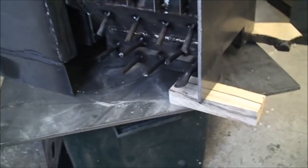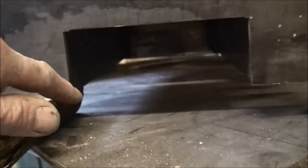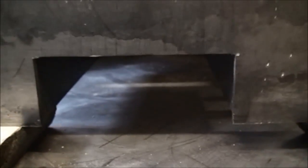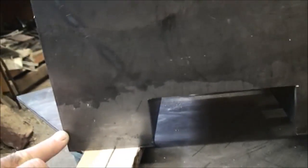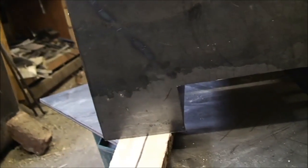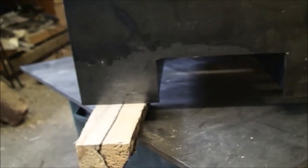So I added an extra inch and a half on that, which gives me room underneath the firebox. You see they're propped on them two bits of wood. Inside the firebox I'll just have to weld a plate on the bottom — there was no plate on the bottom because the shroud was going to run across the bottom there — so I'm just going to weld a little plate in underneath the firebox to enclose that and stop air running up into the firebox from there. This is now off the ground somewhat, so I'm going to weld a couple of bolts onto that to act as adjustable feet, because this firebox does need supporting — it's quite heavy.